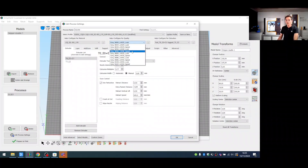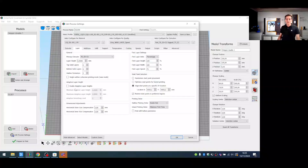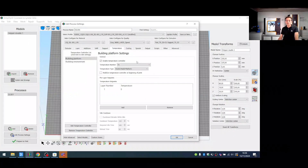The choice is usually between speed and look depending on your need. Today we select the 0.65 mm nozzle diameter with speed mode for a shorter print. With the downloaded profile, all parameters are already tuned. For this specific part, we set two top and two bottom solid layers to ensure there is no air leakage in the gripper, plus other parameters like temperature.